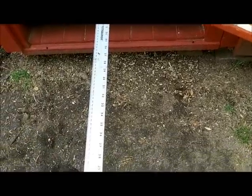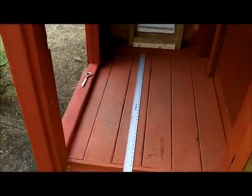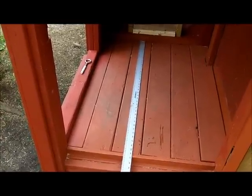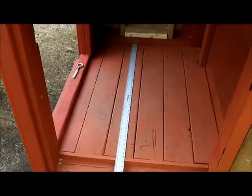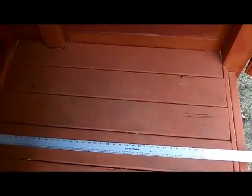You're asking: why do you want to pull the thing out? The simple reason is if I need to get at the back of the generator — the spark plug to change the plug or anything — that part of the generator is going to be facing the wall. So if the generator is sitting in here, I'm not going to be able to get at the plug unless I pull it out. There are several reasons why I want to make the slide.